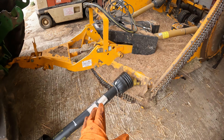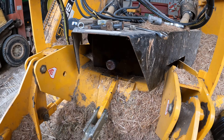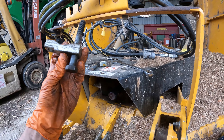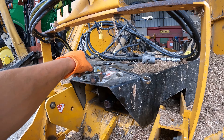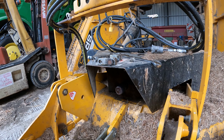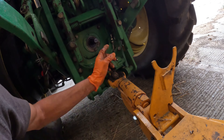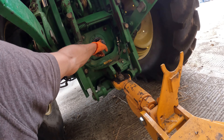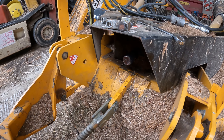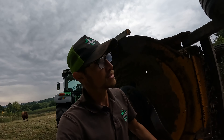Right, we're not done yet. Got the shaft back over here with the topper. I've got to get this end on here, which is a tricky one - held on by this bracket, two of them together, one goes on top of the other, two 22mm bolts. So that one gets clamped on, and then the other end I have to swap the other power shaft around so the 1000 speed one's on, and yeah we've got to get all this on. Finally got away to do some topping.